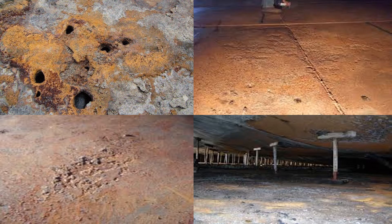Tank corrosion sometimes increases when a layer of water containing soluble salts and chloride settles to the bottom. These compounds are highly corrosive in themselves, and they can generate a strong electrolyte that further promotes corrosion from within. There can be a problem with external tank corrosion as well.